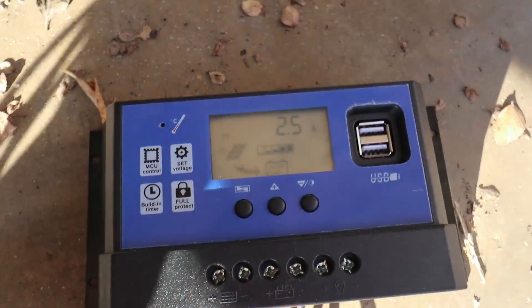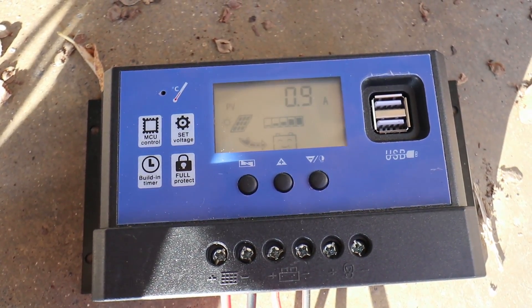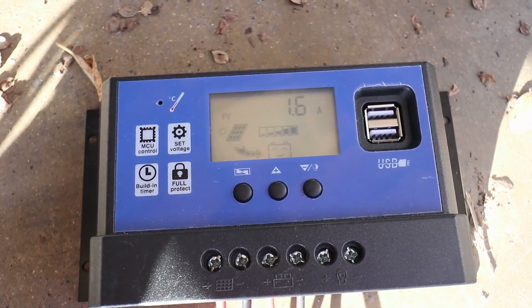The problem is if you want to run this on a 12 volt system with an inexpensive PWM charge controller — tests have shown these PWM controllers aren't junk as long as you get a high quality one — they definitely don't work with higher voltage panels because the MOSFETs will short themselves out with that 46 volt open circuit. They want a panel below 20 volts, which is your standard 12 volt panel.